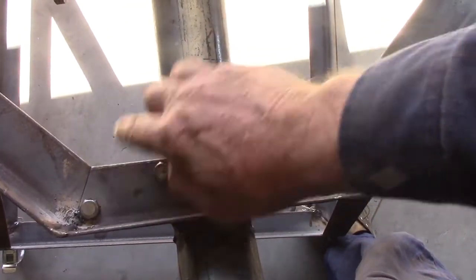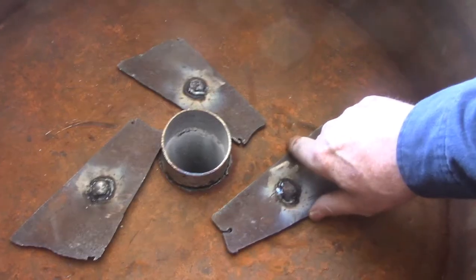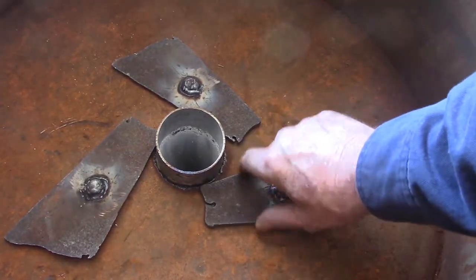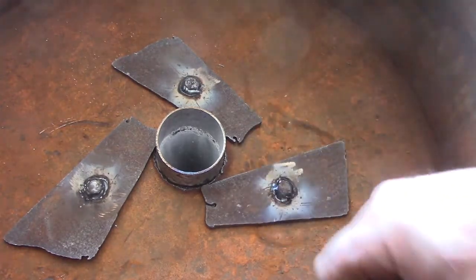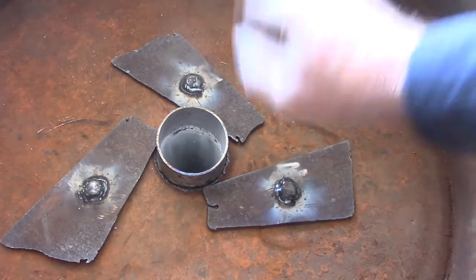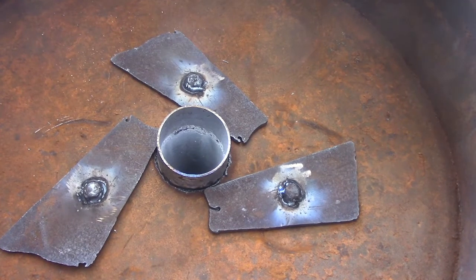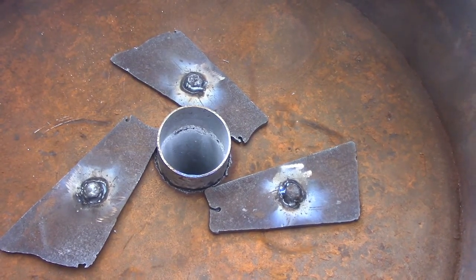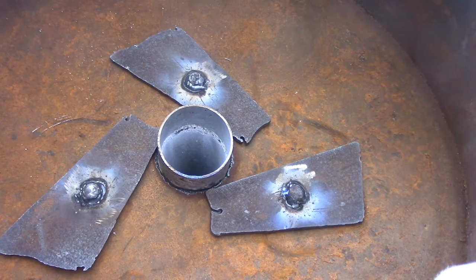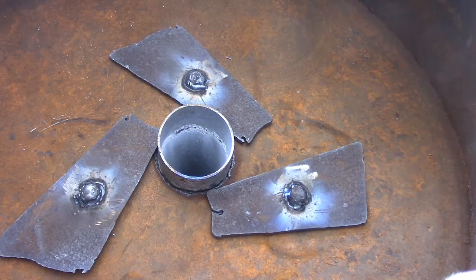Put these 4 bolts here in the frame to hold the pipe in place. Alright, now we've got a view of it. The idea is that if I try to undo these, they twist around, hit against the pipe, can't twist anymore, letting me get the nut off the other side. So I won't run into the same problem I had getting the original forge, because once the cement's in there, I couldn't get to the nut, it just spun around and consequently I ended up breaking the piece. Not that it was held by much, and having seen it once I got it out, I would have tossed it anyway and made a new one because it had been repaired probably several times before. Anyway, that's the deal there.